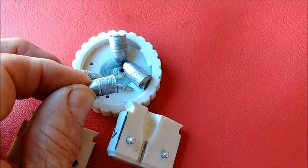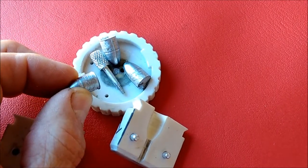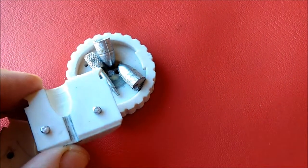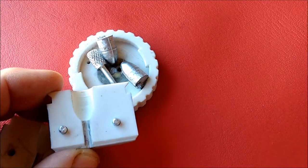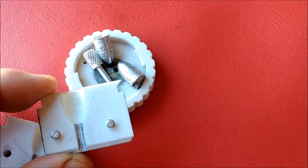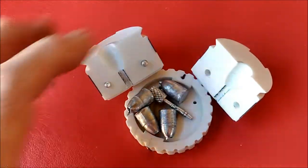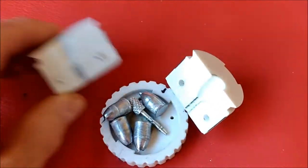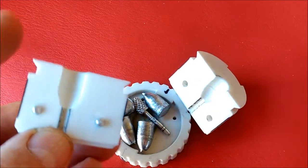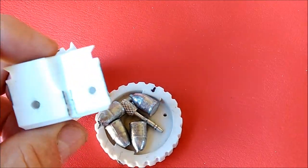I can hold up one of the bullets and see that the surface finish transfers over onto the surface of the bullet. That's the same kind of surface finish that's on the cavities, though I can't quite show it because the white color of the cavities washes it out. That's the damage the heat does to these particular molds. Oddly enough, the second oblong bullet mold cast the same number of bullets and its surfaces are just about perfect — no erosion on that one.